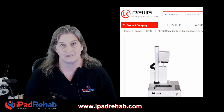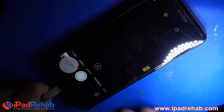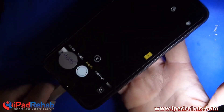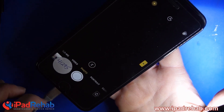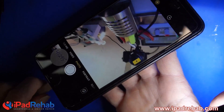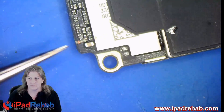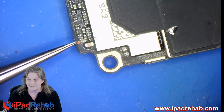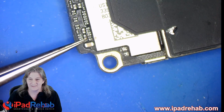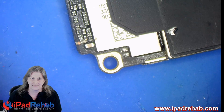The complaint is that this phone had a flash problem right after the repair. Here it is — I've opened it up and the rear camera is not working; it won't take a picture. If I flip over to the front camera, the front camera is working. Let's take the board out and look at it under the microscope. Here's the board under the microscope — we can see the laser damage. If we flip it over, there it is: the laser has just sizzled right through here and these two resistors have been destroyed by the laser.